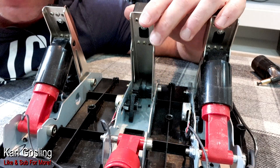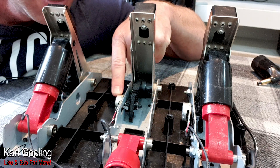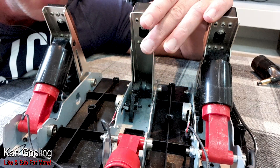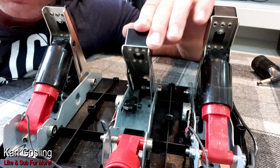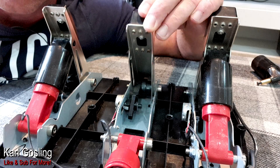This is why you have to calibrate them sometimes, because these are not a super precise item and they can give a slightly different voltage top and bottom. When you calibrate them, you calibrate them all the way up and then all the way down, and that way when you vary in between, the range is correct.